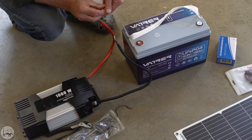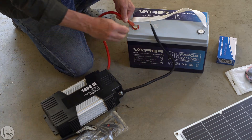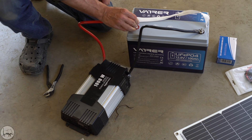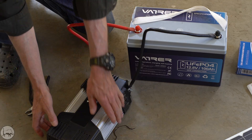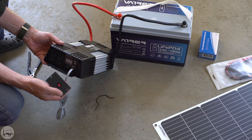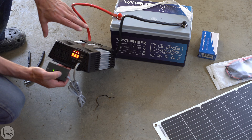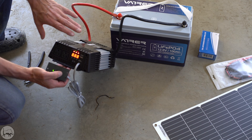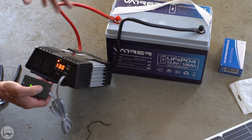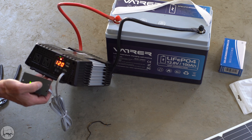I'm connecting the positive first and cinching it up, then getting the negative on there. Now popping in the positive side, cinching those two up, putting the little cap on. That's ready to go and will have power now. I've hooked up the extended on/off switch — that's a pretty cool option. Everything's working, so I can plug in whatever I want and this battery is going to run it through the inverter. The problem right now is nothing's charging the battery, so let's get the next two components hooked up.